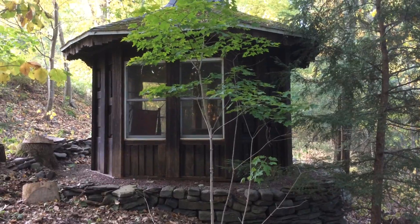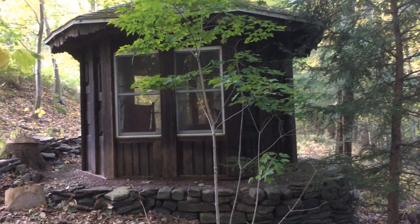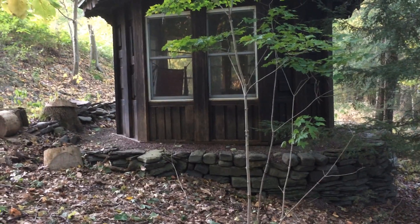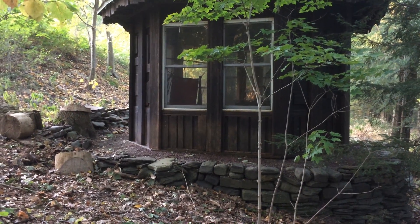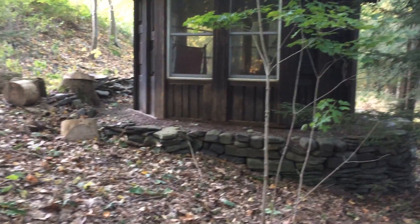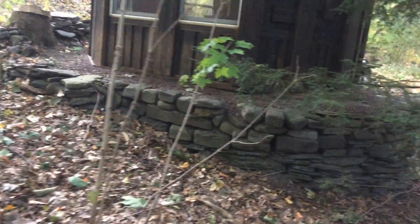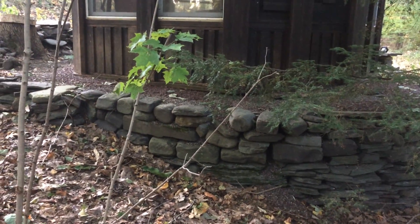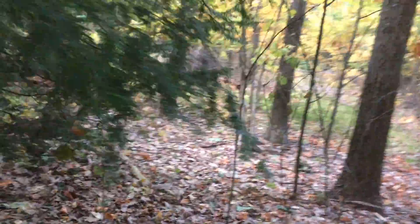I'd say some more about the base of the gazebo. The most important aspect is the foundation of most buildings — anything you really want to last. In this case, I didn't have a flat area to build the gazebo where I wanted, but we really liked this spot. It wasn't too far from the house and was near our sand core area. It was a hillside, but that actually made an opportunity to build a massive foundation. I started using fieldstone — big stones I could get — and began piling a perimeter.